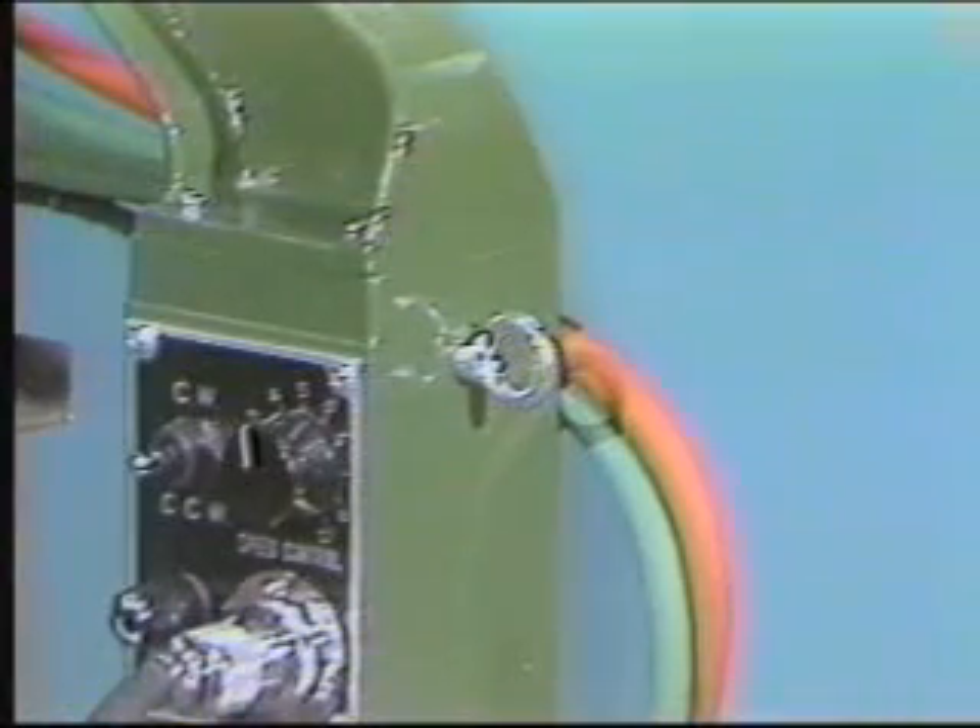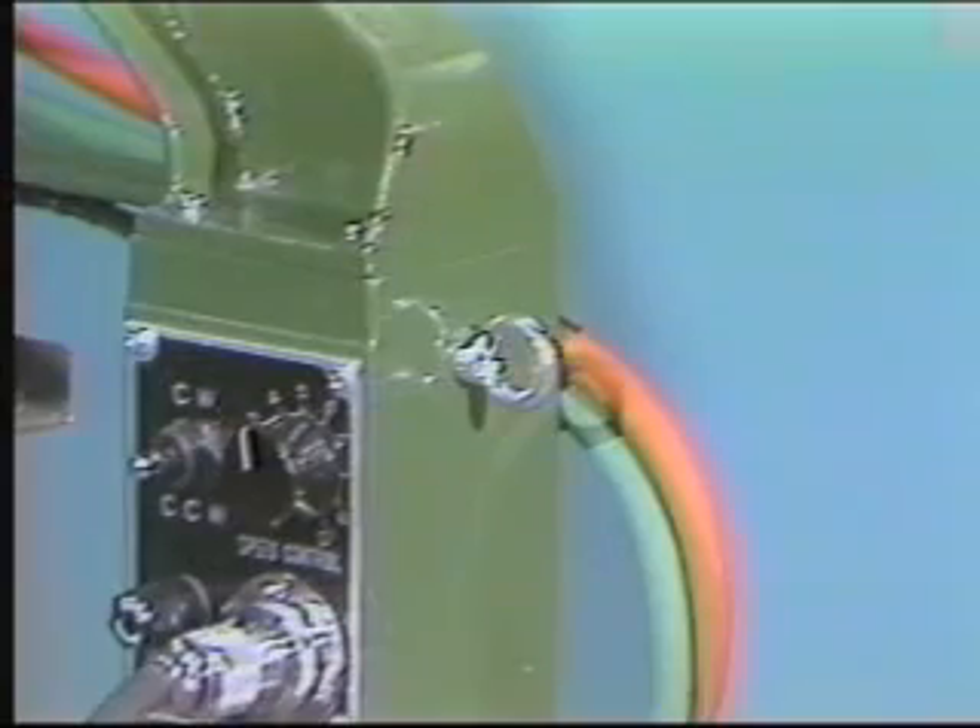Tech tip number one. When cutting out of position, attach a chain or cable to the safety ring on the back of the housing to prevent the machine from falling should the power fail.